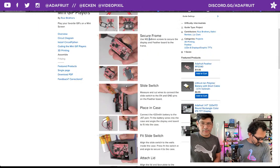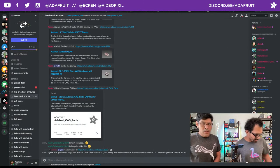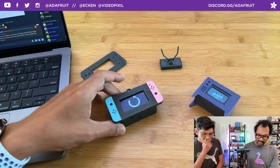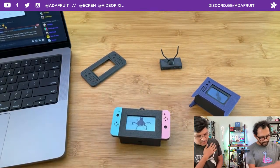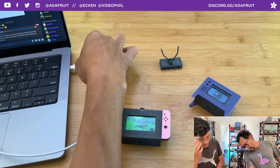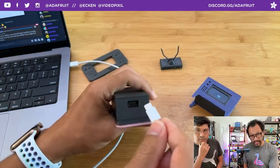Let's see. Cool. Paul Eric on YouTube is asking, I get it uses a battery, but does it also charge and maintain it? Yes, there is a charging circuit on the Feather RP2040. Plug this in and it will charge it. There's some polarity protection as well, so you won't blow up the battery and things like that. It's very nice. Just to show what that looks like, you can see the little indicator turns orange when you plug it in.